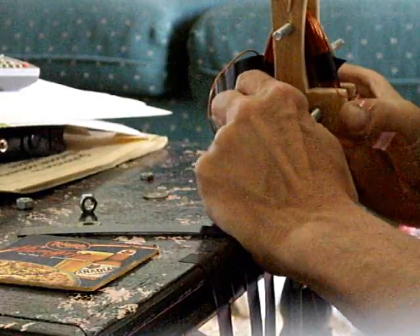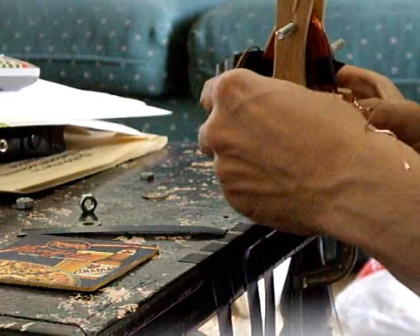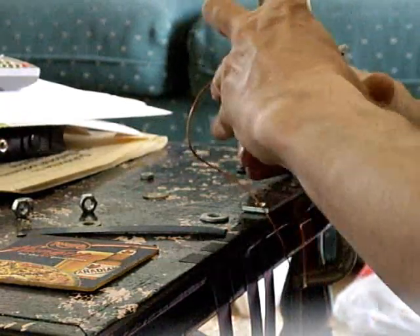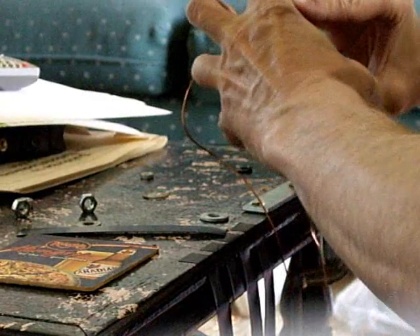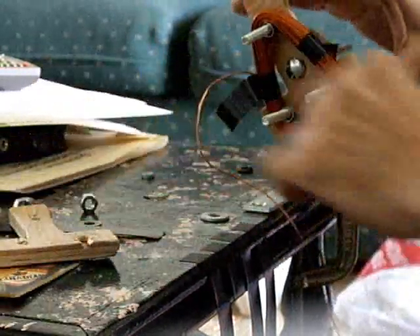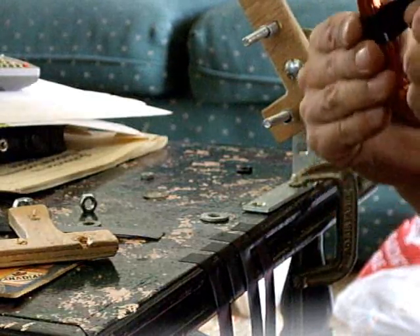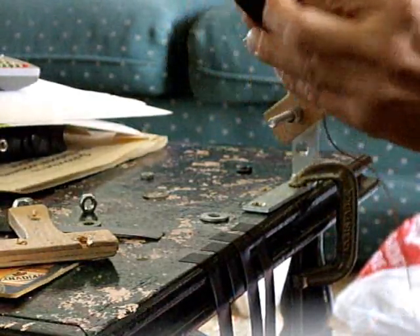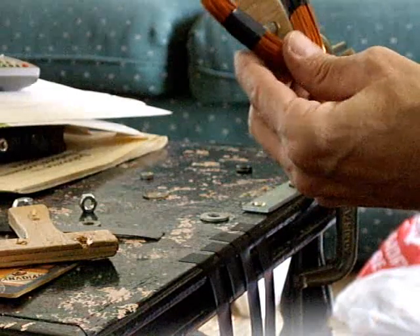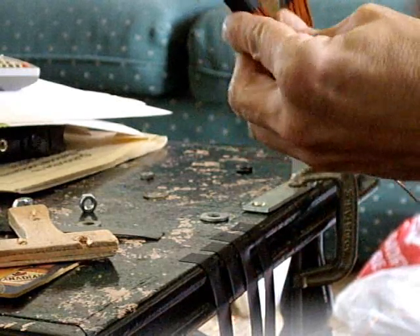Other tips of the day: when you're working with these coils, try to remember how many turns you put on — that's the most important part. Now we can pry this apart, get the T apart here a little bit. Got the T off, pull my coil out, put my tape tabs on the rest of the way. And one pretty decent looking coil! 80 turns, number 18 wire. And if we're all happy, we'll snip it off and ready for the next coil.